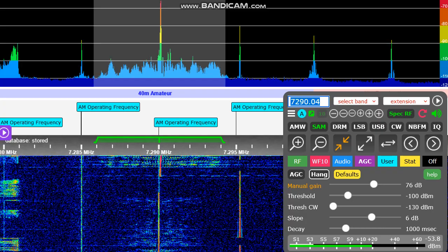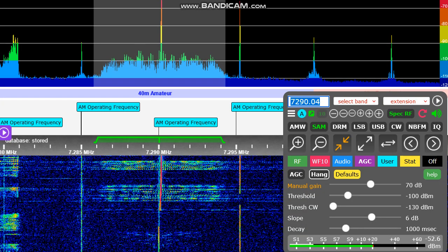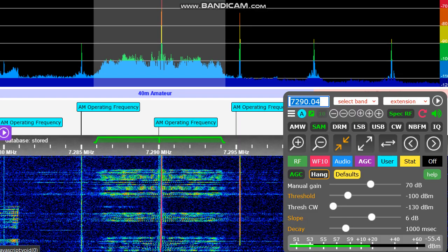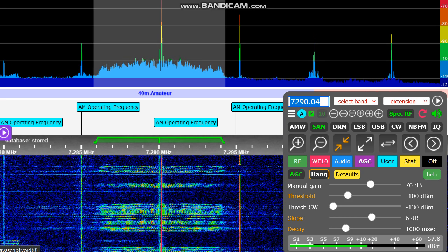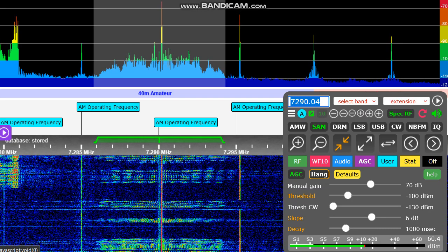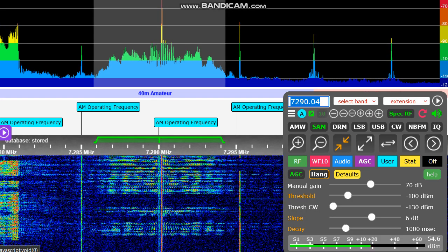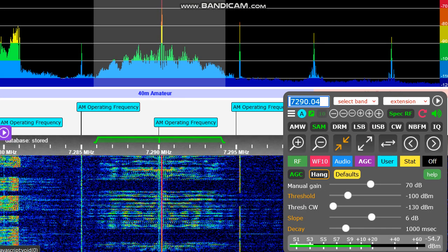Okay, well, no need to apologize. You know, you got to run what you have. They took a fade out pretty deeply at the end there. We're running 100 watts out of a 32 V3 low power station into a fan dipole up about 50 feet, cut for 80, 40, and 20. Listening to you on a homebrew single conversion superhet.